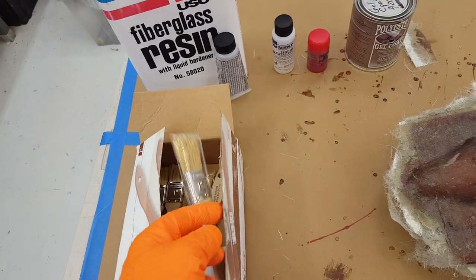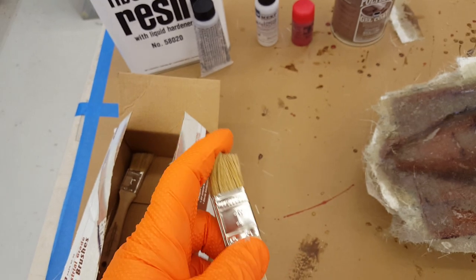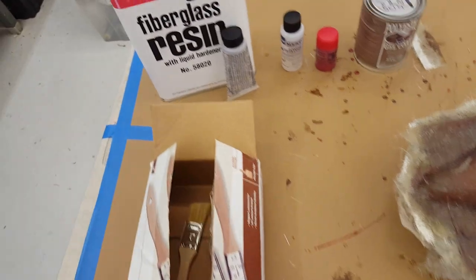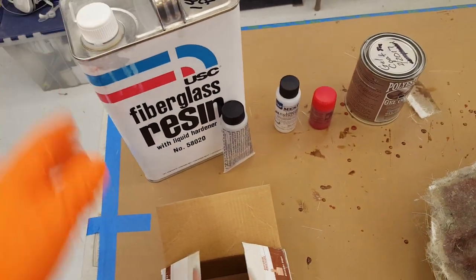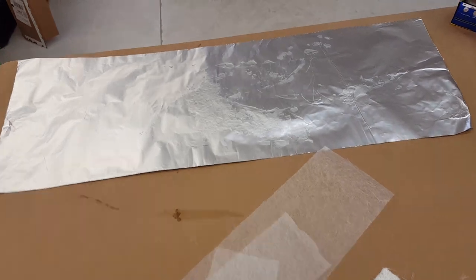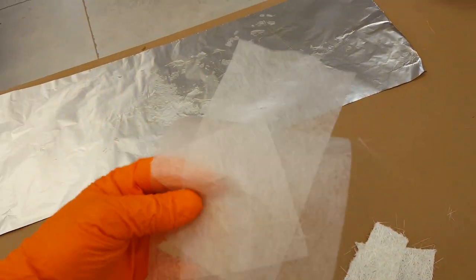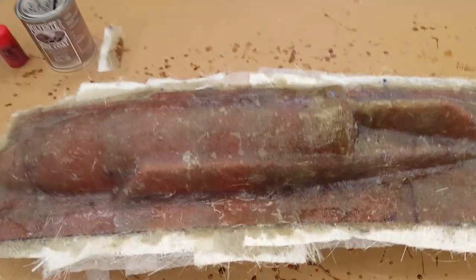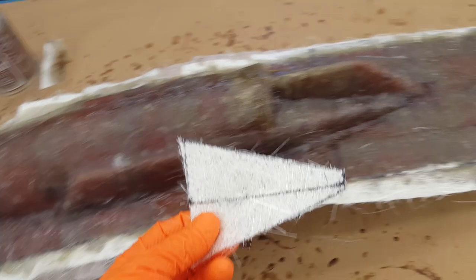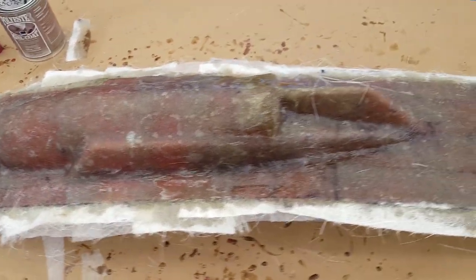I get these super cheap brushes for applying the fiberglass and I tend to cut them shorter because as-is the bristles are long and flimsy and don't apply fiberglass very well. I'm a fan of this simple, relatively inexpensive, easy, and very consistent-to-mix resin — but boy does it move fast. Cut all your stuff and get everything ready to go. I like wetting out on aluminum foil; it works well and kind of stays in place. Don't try to wet out your veil — the mat will just fall apart. Apply your resin right to the part, lay the veil on it, work it in, then move to a heavier one-and-a-half ounce glass and make several layers. You can't put on too much; you can definitely put on too little.